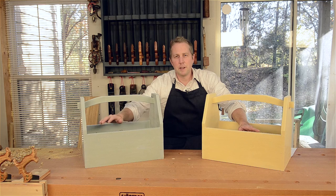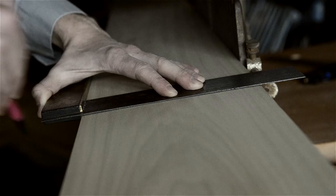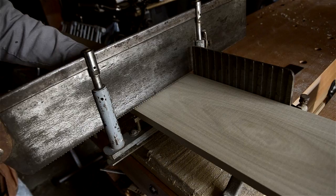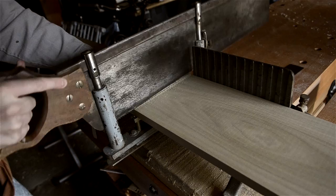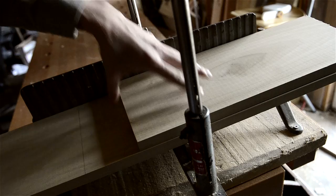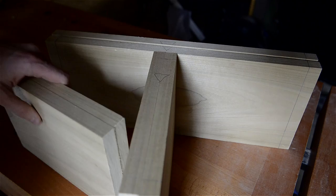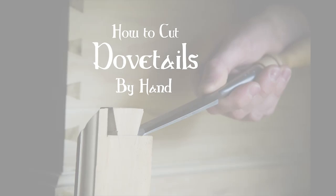If you find this project helpful, subscribe and share some comments. Let's get started. Begin by squaring off and cutting two pieces to 18 inches in length on a miter box saw. Make sure the saw is adjusted to cut straight, and you can square the end with a block plane after cutting. I like to set the first piece on top of the board and scribe an exact measurement from it. You'll end up with two 18-inch pieces and four 10-inch pieces; two of those will be used to make the dovetail box. If you don't know how to cut dovetails with hand tools, check out my tutorial called 'How to Cut Dovetails by Hand.'